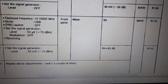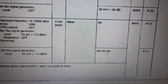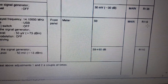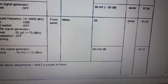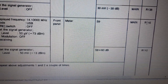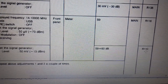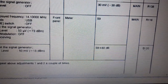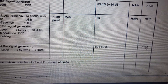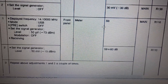These are the settings at the front panel and the meter. For S9 and S9+60 dB, the location is on the main board and the adjustment points are R116 — we need to align this for S9 with the input from the signal generator. We need to tune R116 for S9 at the S-meter, and S9+60 dB we need to set by aligning variable resistance R110. This way we can perfectly calibrate the S-meter for S9 and S9+60 dB. This input signal is really necessary.